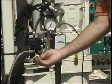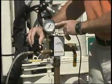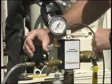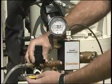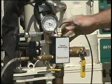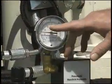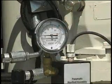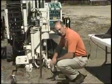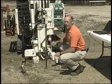Now I'm going to open the inlet valve here. I'll start opening the pressure regulator — I'll have to turn it around a few times and we should start seeing air come into the system. The gauge will go up — it's going up to about 15 psi. I'm going to close the inlet valve and let it stabilize. You can see the gauge dropped a little bit — it went up to a little over 15 psi. Now it's coming back down and stabilizing. What we're seeing is we increase the air pressure in the rods, and as we increase the air pressure, we push the water out down through the rods and out of the screen into the formation. Now it's stabilized at about 9 psi.